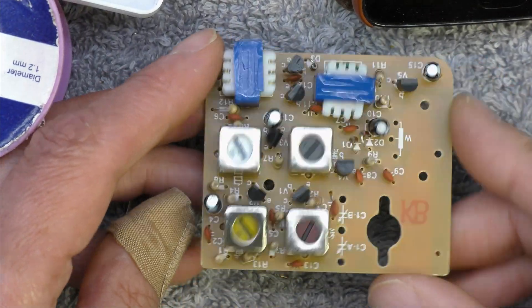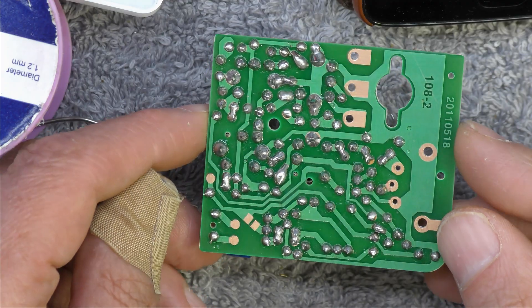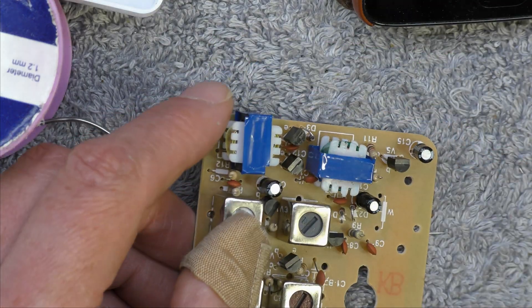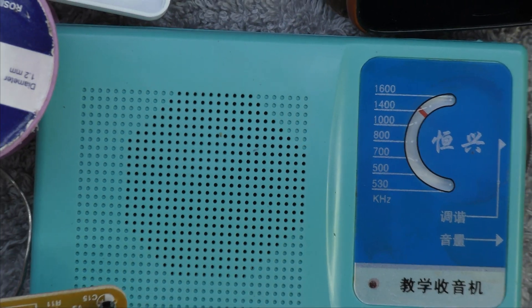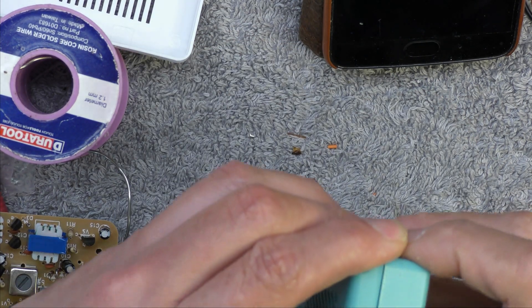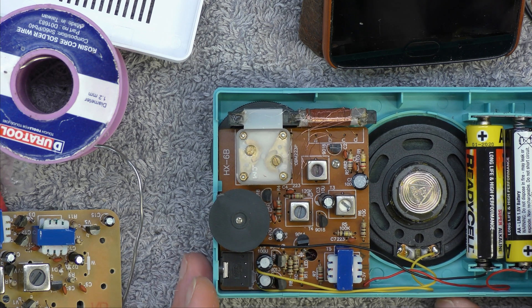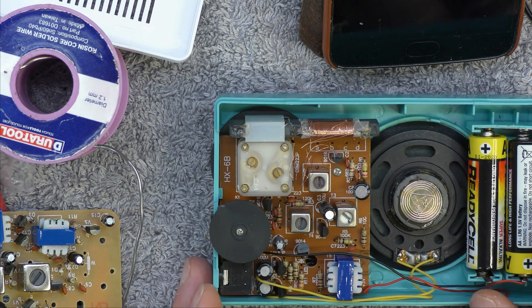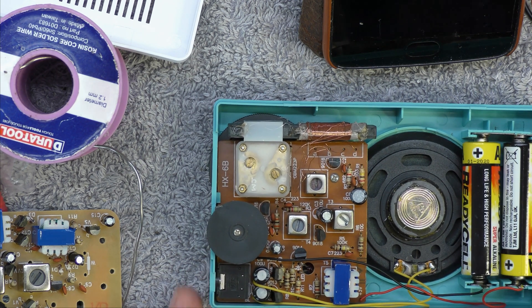It's coming along nicely. I've linked out some of the links apart from the one on the output stage. Just looking at the blue radio I've got - this one only has one IF stage if I remember rightly. I can only see the white IF transformer there, so I assume it's only got one IF stage. I built this quite a while ago.